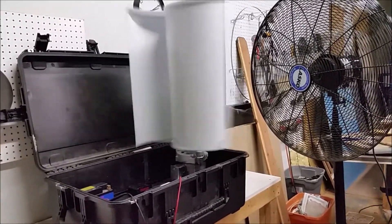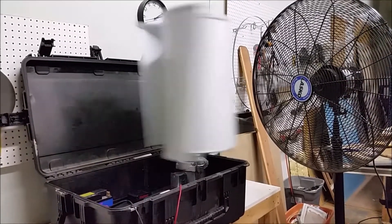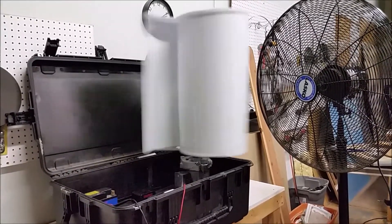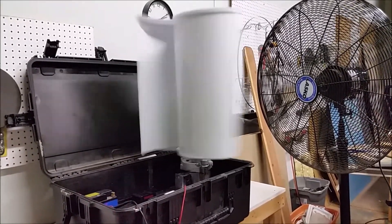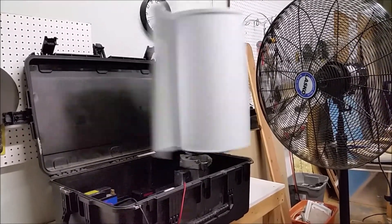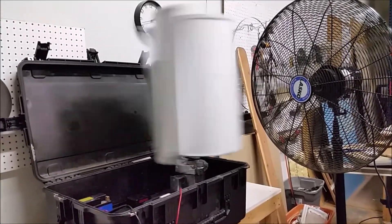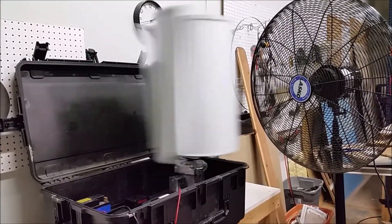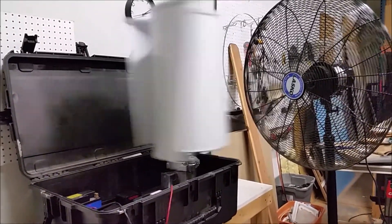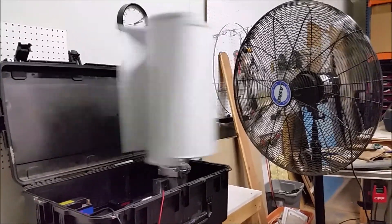If you wanted to increase the power being produced, you could increase the wind sweep area by increasing the size of the blade. You can get probably another six to eight inches in diameter and go as high as another four or five inches in height, and still fit it in the suitcase. That means it would have more power — not just charge faster, but produce more power overall.